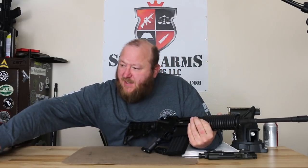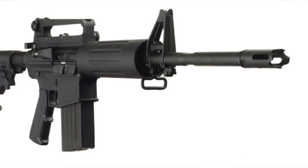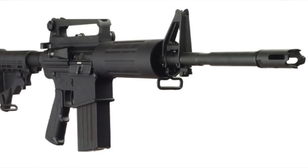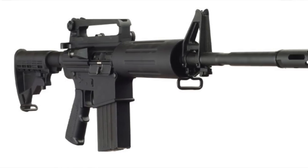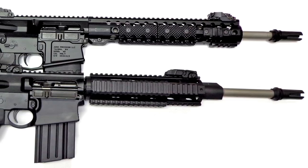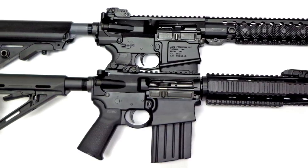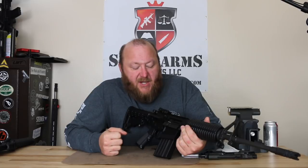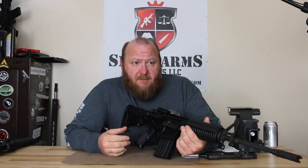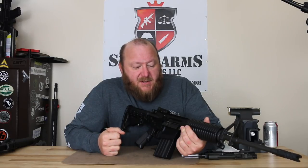So what we're going to be talking about specifically is the AP4. Now the original AP4 carbine was based off of standard AR-10 type receivers. Of course you had the DPMS round receivers in the back, but the Gen2 was a shorter receiver. Basically what you did was you shortened down the upper and lower receiver to make the rifle more compact. By doing that you're looking at making a whole bunch of proprietary components such as the upper receiver, lower receiver, charging handle, bolt carrier group, and bolt. Those parts became proprietary because they are sort of right in the middle between an AR-15 and an AR-10 in size — so if you want to say AR-12 and a half, that's probably more accurate.